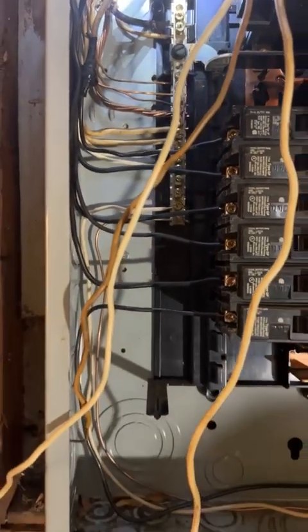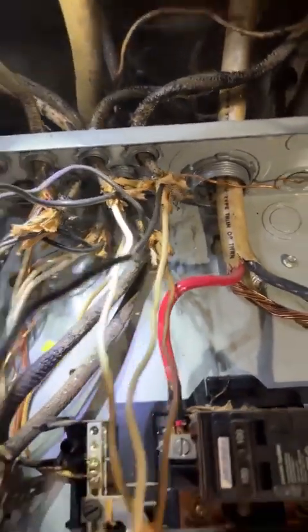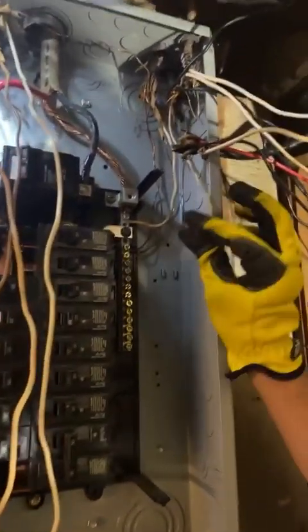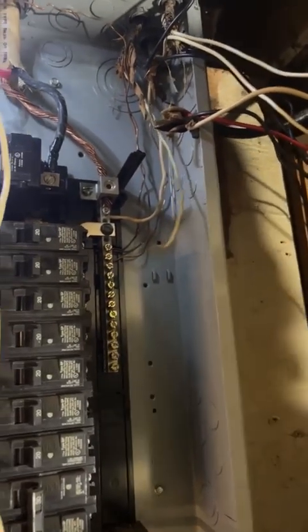I've been cutting the extra wires off. I cut the sheathing to where it's only about an inch into the panel there. We tried to do 90-degree turns. That side is done, and now basically I'm just working on this right side. You can see there's excess wire — you don't need all that. You just want to cut that to about right there, and that's all you need.